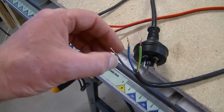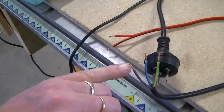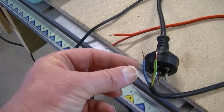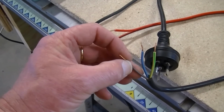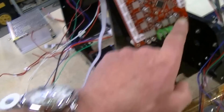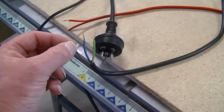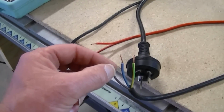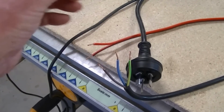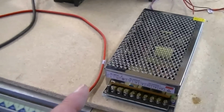electrical current, because what happens is you make contact with the outer layers, but sometimes over time the inner layers don't have any contact. So that means you get what they call high resistance, and it starts warming up, and it can give you a bad connection. And when you're talking about electronics, because that is going to eventually supply these electronics, and certainly the processing chip there, it can cause you problems, and it could make it fail. So what you do is you make this one solid mass by melting solder into the whole bit of copper metal there. You make it one big strand just here where the connection is.